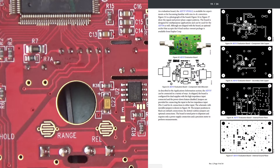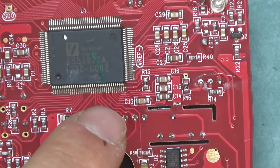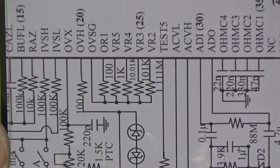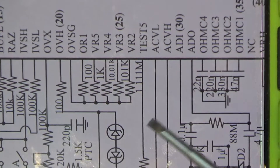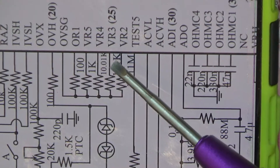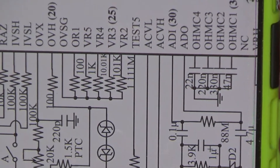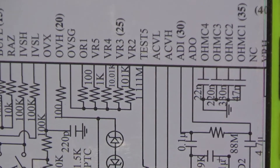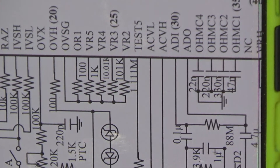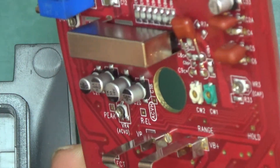There is even an available AD737 evaluation board which you can order or make yourself. And the little can — looking at where it's connected, all those traces go into those pins. I had a look at the data sheet and here is what's inside: precision resistors — 100 ohm, 1K, 10.01K, 101K, and 1.111 megohm. Those are reference resistors in a shielded can, probably on a special substrate, and they provide the accuracy of the multimeter. I have not seen that before in any of my previous multimeters.